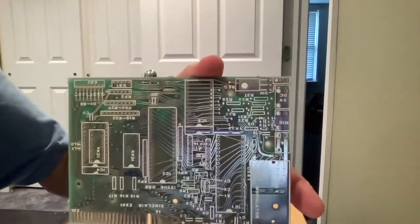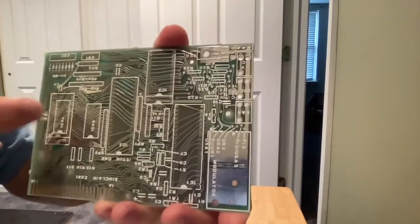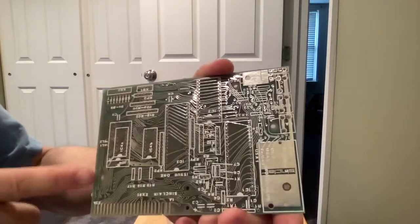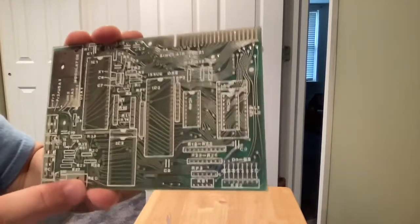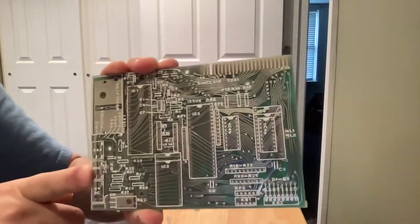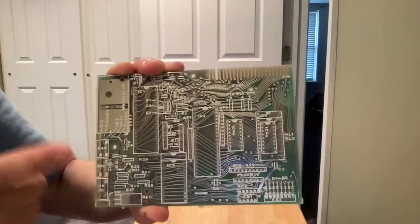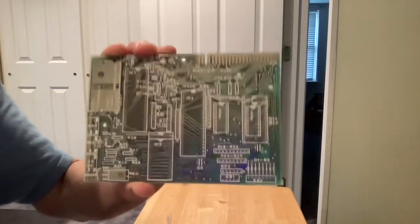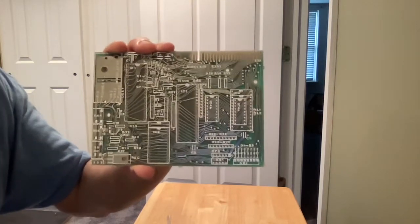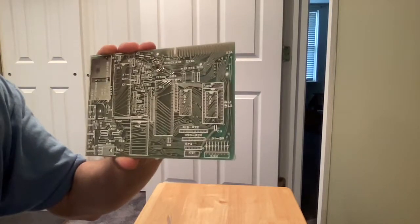Let's look at this beautiful motherboard — look how tiny it is. The whole computer is six and a half by six and a half inches. You would have to mount your sockets, resistors, capacitors, and everything else. Here's where the voltage regulator goes, the 9V DC jack, your earphone and microphone — for connecting to your tape recorder. The earphone jack has to go to the earphone jack of the tape recorder, which confused me at first before I read the manual.